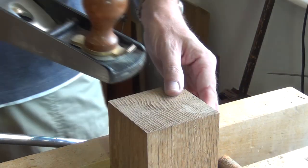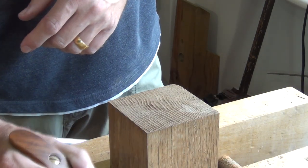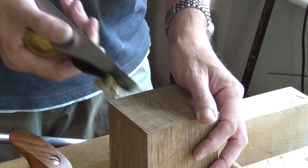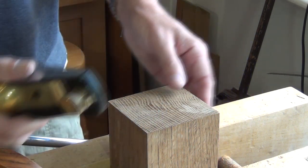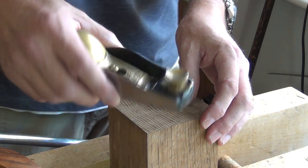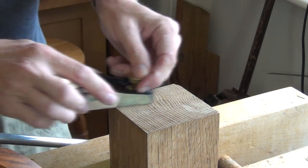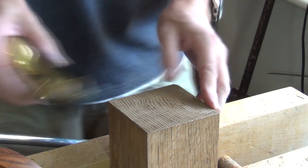A low angle plane, like a low angle jack, can end up with similar problems. But you'll notice this is very similar to a block plane setup — you've got a blade bedded at a low angle. Being called a block plane, people often think it's because butcher's blocks were finished with these. They weren't really; most of the time they were done with a larger plane. But with the low angle plane — a low angle bed and a 25 degree bevel on the iron — you can get reasonable shavings. It's worth just putting a bevel around the edges, which affords a bit of protection when the plane comes right the way through.